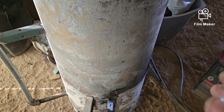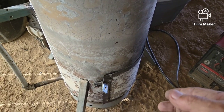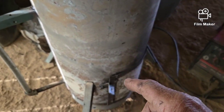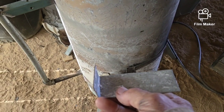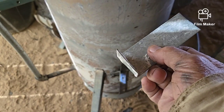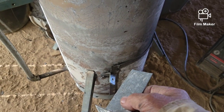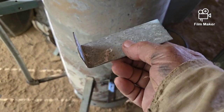This is just a draft doing that — I've got holes drilled in the bottom and air coming up. One of the things I did was where the feed pipe sticks out on the inside, I welded a little metal plate on there. The oil drips onto this plate, and it gets hot as the flames burn. What it does is vaporize the oil when it hits that plate before it actually drops down into the pot, making it burn a little cleaner and hotter. I've already noticed the difference in heat output.